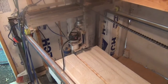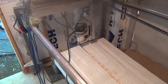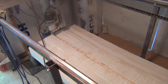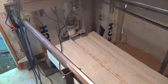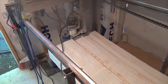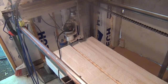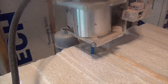Now I'm ready to mill the deck now that the stringer is done. I bring the router bit back to the initial position at x equals zero at the nose, y equals zero at the stringer, and bring the router bit down so it just touches the milled stringer. Then I run the deck milling program, telling the software where the router is starting. It mills the deck in a serpentine pattern across y, moving down along x towards the tail. As it passes the stringer it should not cut into it — it should ride just above the stringer.